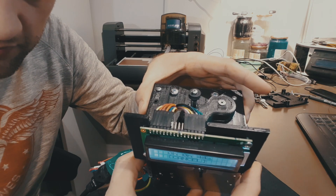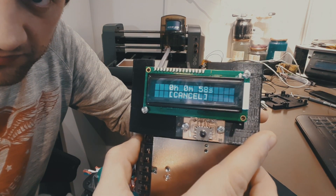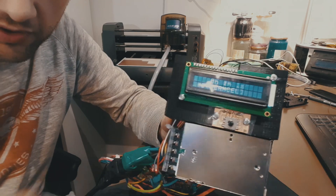Take a look — it's turning very slowly, but it's turning. And there we go, it stopped turning — it's one minute, one second. It is one second over because I have to add one second to avoid dividing by zero. So it works! There's a lot to make better — I want to use microstepping, and I need to optimize my code because I'm already at 87% of my Arduino Nano. I need to find a way to optimize it so I still have room for the other two modes.